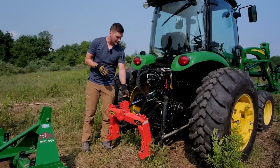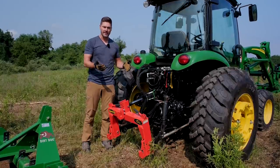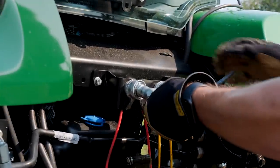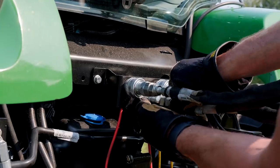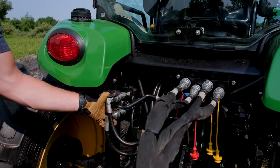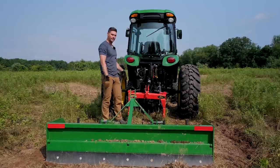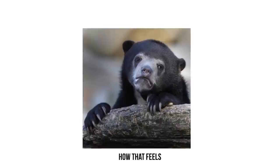But then on top of that, this hydraulic top link quit working at the exact same time. I'd actually turned the machine off and back on while diagnosing things and decided to disconnect these two hoses and flip-flop them. It went from a fully extended position on its own — without me pushing any buttons — to a fully retracted position. When I flip-flopped them again, it went back to fully extended without pushing any buttons. But as of this weekend, the fifth function worked just fine and the third function, routed all the way up front to open and close the jaws of my grapple, also worked fine. But when we came back out, got it jumped and fired up, all of a sudden the third function's not working either. Things seem to be getting worse.